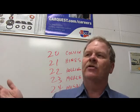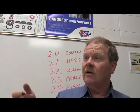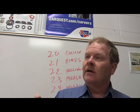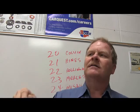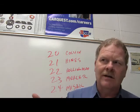How many of you guys have ever used a torch and burned a piece of metal off? Like you take a torch, you get it red hot, right? And then you pull the trigger. What's happening when you pull the trigger on that torch? Like a pure stream of oxygen. And that oxygen oxidizes that metal. You're basically rusting it off of there. Because rust is iron oxide, right?